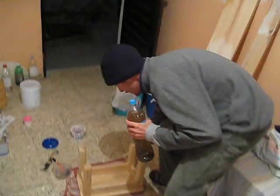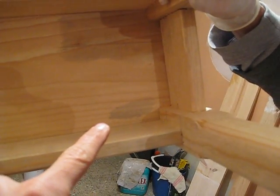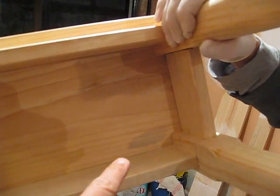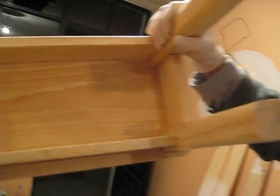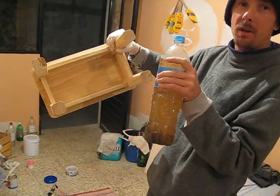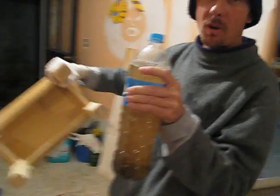You can see right here how it's turned gray just over 20 minutes or 15 minutes of putting the solution on there. This one is from a few hours ago, and you just dilute the solution to the strength you want — how dark you want it. So that's just vinegar, water, and rusty nails. That's right.